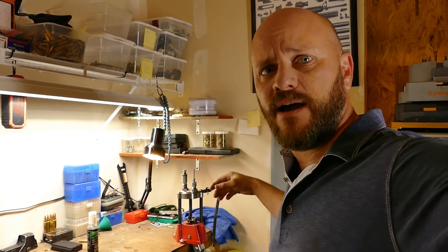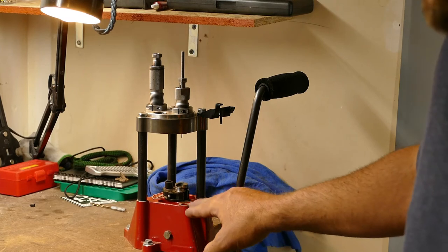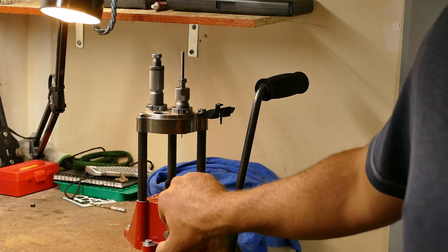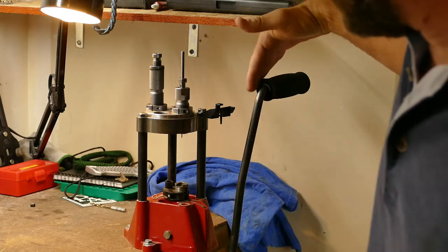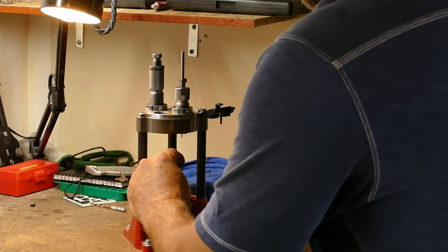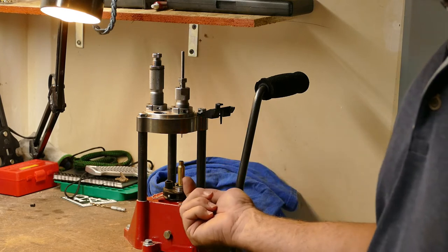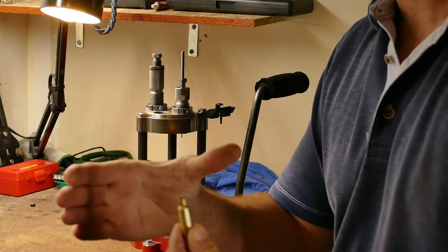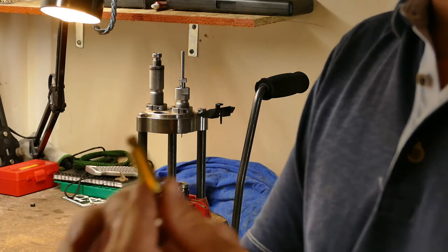The last step I'm going to cover in this video — I'll zoom in on my reloading press. Right here I've got my reloading press; there are a lot of different kinds of presses. This is a Lee Precision press. I know some people out there, if you reload, you just said precision and Lee in the same sentence — yeah I did, it's okay, this is a decent press. As you can see it actuates on a cam and drives the piston up. It's got a shell holder here, which you'll also need — appropriate for the cartridge you're reloading. This die is going to shrink the case down to SAAMI specs, which is the industry standard.